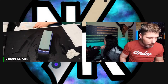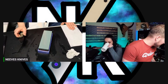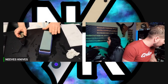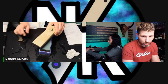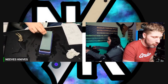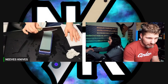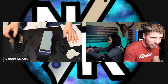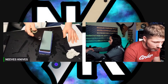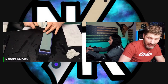So one thing I can tell is, using steels like this on these stones is not good, especially this one, because the lower grits are a little bit softer. My next stones are really hard, the 1,000 and 6,000. This 220 and 800 is kind of soft. And with steels like this, even though it's a simple steel, this one is going to be heat treated softer and this one a lot harder. So it definitely wears the stone out a lot more than that one would have.